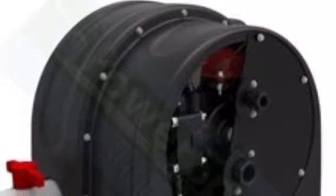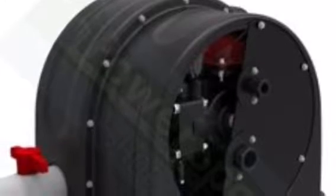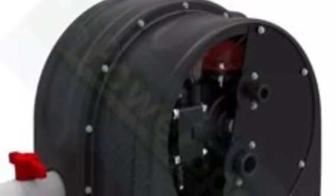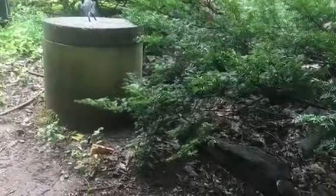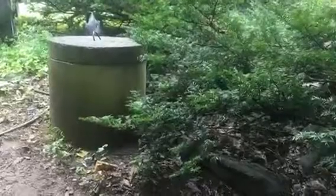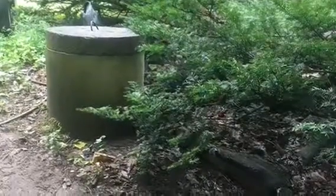Although this unit looks almost identical to the power generating unit, this is a Pelton wheel driven hydraulic water pump. Its benefits in operation: it's quiet. It can be powered by a low cost plastic penstock, which is the pipe. It's light and easy to work with. This thing will pump 2 different water sources. We will use the stream to power the pump. We have a concrete cistern on this property that generates spring water, so it will be pumping the clean spring water up the hill, approximately 80-90 feet, giving the people somewhere between 35 and 40 pound of water pressure, depending on what house it's going to. They'll have sufficient pressure. I'll show you what this pump looks like taken apart.